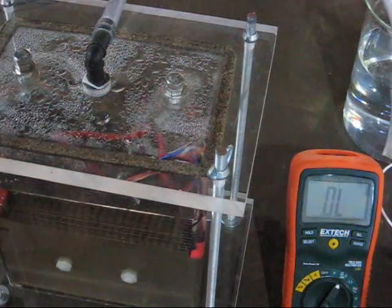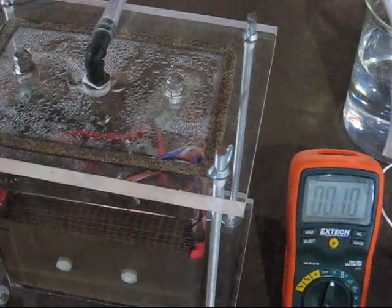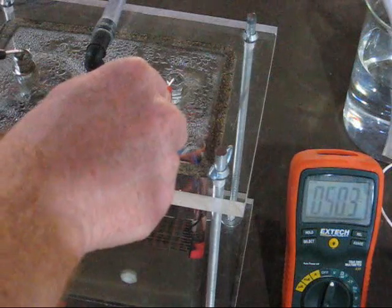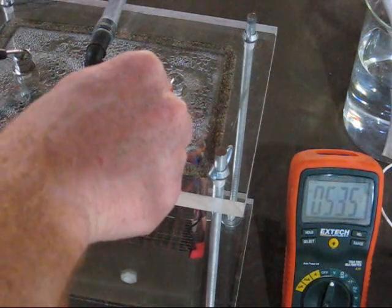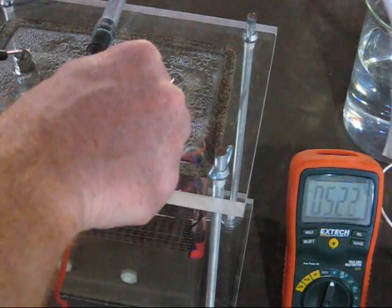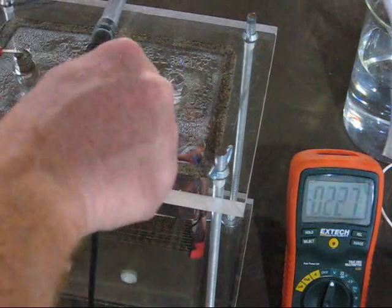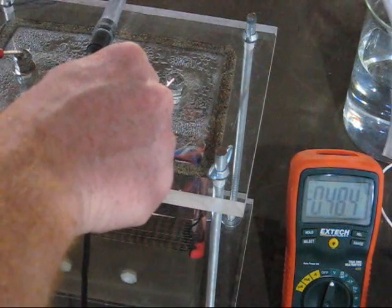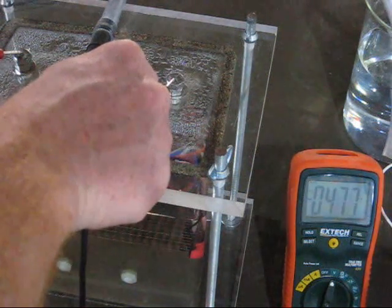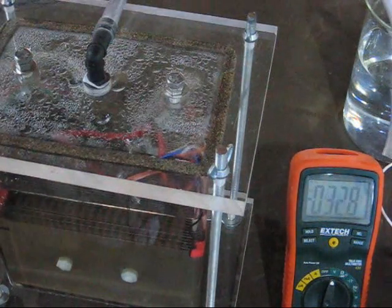Just to emphasize this effect, I'm going to put it on a voltmeter and put it across those leads — it reads 53 millivolts, and it will start going down as the charge goes into the multimeter. If I reverse this, it'll be minus 48, 47 millivolts now. So it does indeed work like a battery.